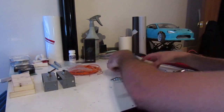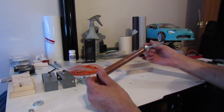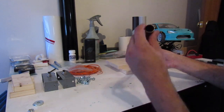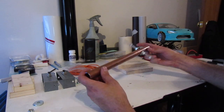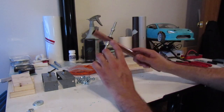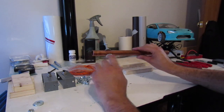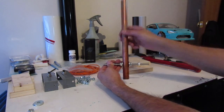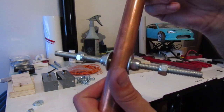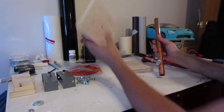We have our little copper pipe that we've been using for the handbrake — we can use it again. We're going to wrap it in green and probably put a shift knob on it later, maybe an energy drink one. We have a crossbar that I basically drilled a hole through and put a threaded rod through. I got the threaded rod from Home Depot — it's a 5/16 threaded rod with some lock nuts and two washers so that the bar will move freely.